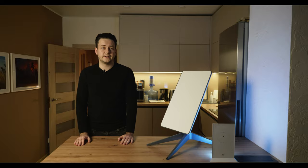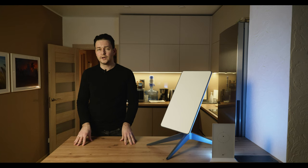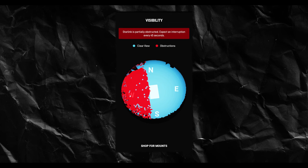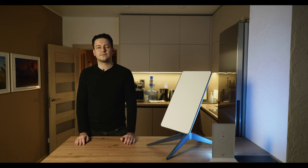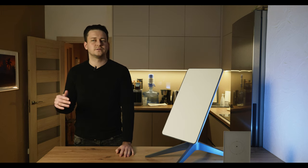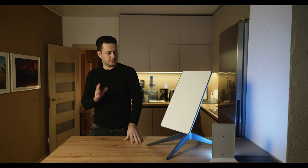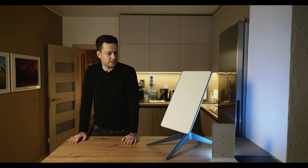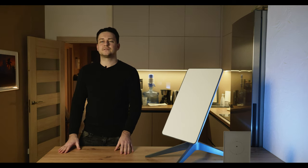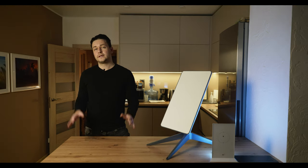Back to apartment installation — in my case the mount was one meter long but that was not enough. The Starlink application clearly shows that the house wall creates a big obstacle, causing internet interruptions every 48 seconds, which means Zoom calls or streams will have problems. It is also interesting that in 12 hours of operation Starlink optimizes itself and starts working more stably, collecting information about obstacles. During this optimization it cannot be turned off from the power grid, which in my case is impossible without a power station.